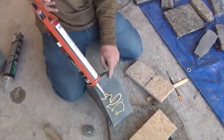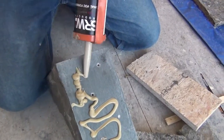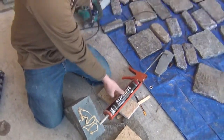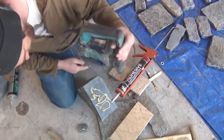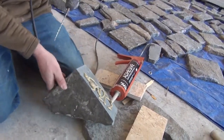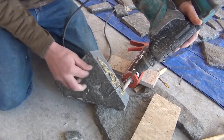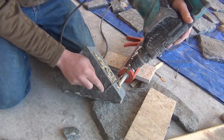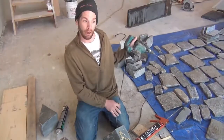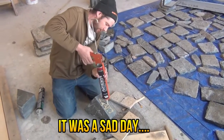I've already drilled these holes — this is where you can have a disaster. Use a hammer drill with a 5/16 bit to drill these. Think about where you're drilling: it's way better to drill up here near the top and stop early. If you drill down here and only go a half inch to an inch and a half, you can have a blowout out the other end. Don't ask me how I know that — it's something to avoid.